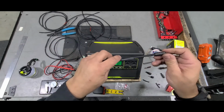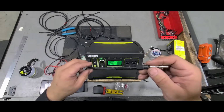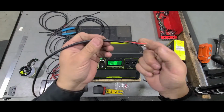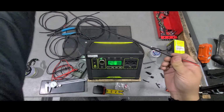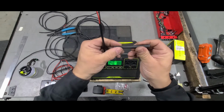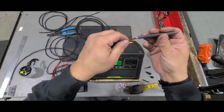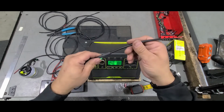So before you put this thing together, there's steps, and you need to pay attention to the steps, because I kind of goofed it the first time and it's all bad. What you do is you have your cable that you set up, tinned, ready to go, like let's solder this together. But you have to make sure, number one, that your outer shrink tubing is cut to 3 inches. This is going to slide on first, because this is going to cover everything when everything's all finished up.